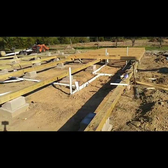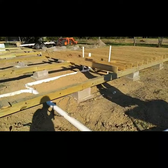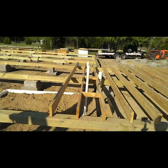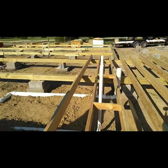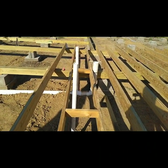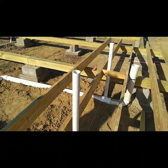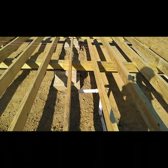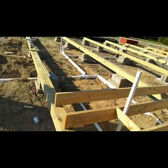Like this pipe here will be connected to a floor joist with some plumber's tape — it'll be rigid, stiff, won't bend. Let me show you the master bath real fast. It's pretty, ain't it? For someone that didn't go to college, I'd say that's pretty all right. My dad taught me how to do plumbing. He said, son, it's just like things in business: poop runs downhill. Just don't let your poop outrun your water, or your water outrun your poop, one or the other. This first vent is the master bath sink, and then you have the toilet. And this line runs along here and it'll catch the tub.